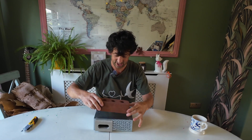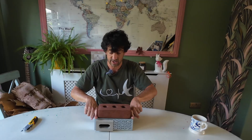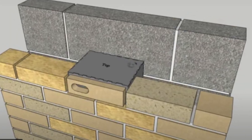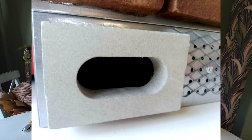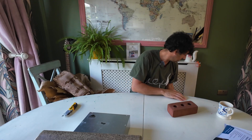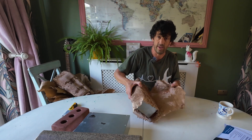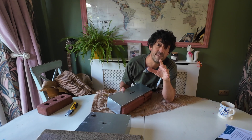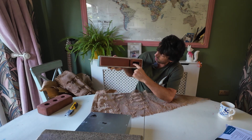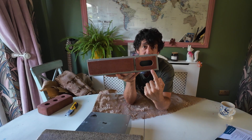That's just about the width of a brick allowing for a mortar joint either end, so it's going to be really easy for bricklayers to install. Isn't that absolutely brilliant — so simple, a little swift brick to go in when you're rendering. There are lots of different types of swift bricks on the Action for Swifts webpage, and they are the go-to boxes I recommend, especially in commercial situations. Did you know a swift can enter its nest hole at 40 miles an hour? The hole size is really important because we don't want other birds getting in — just swifts.